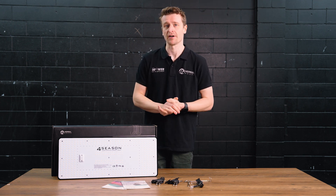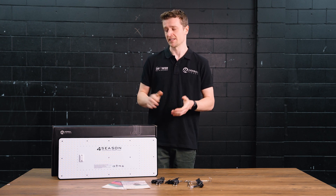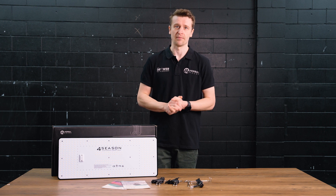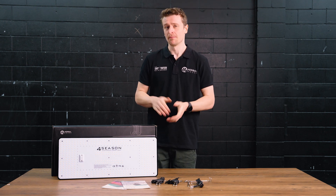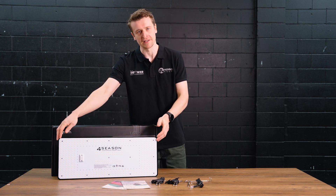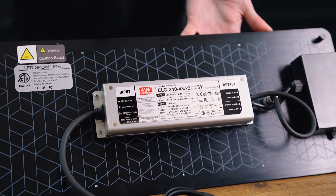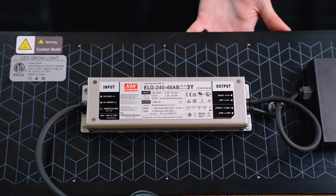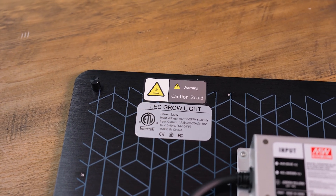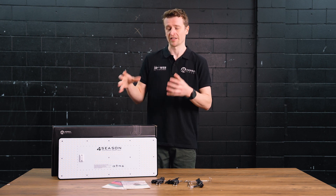What you can't quite see up close is that the diodes and the entire front surface of this panel are covered in a very fine gel coating, making it up to the task in harsh conditions — high humidity and high corrosive environments. Moving on from the PCB surface, it is bolted to a black aluminium heatsink that is six millimeters thick — thicker than the industry standard — meaning you get a cooler, more efficient running panel. The heatsink absorbs heat from the light and rejects it, resulting in a cooler, sturdier panel.